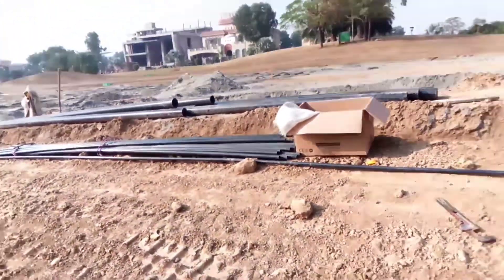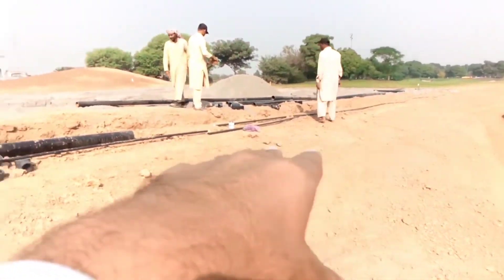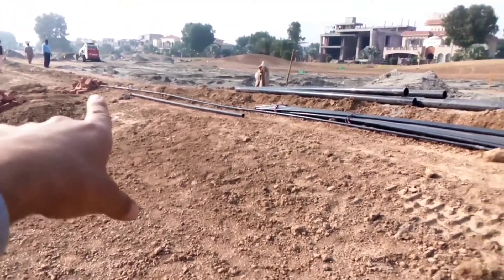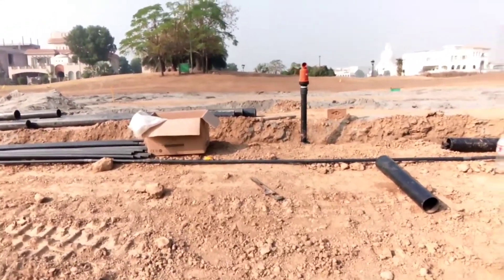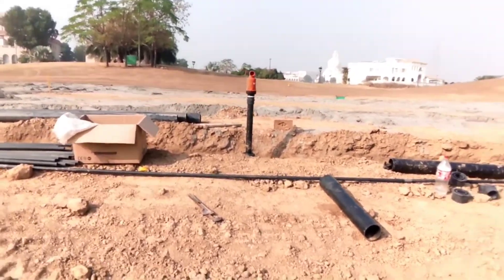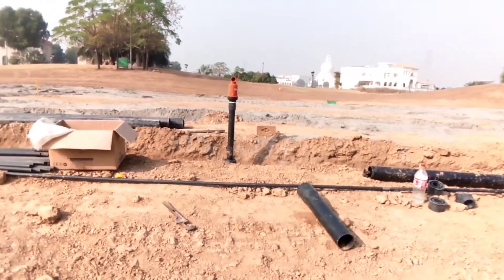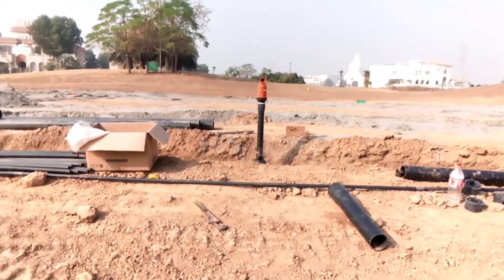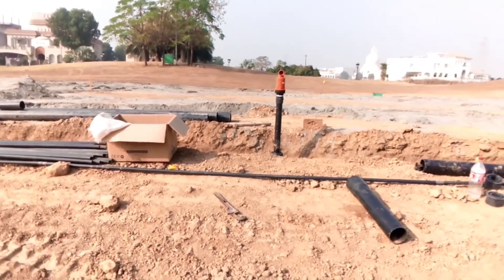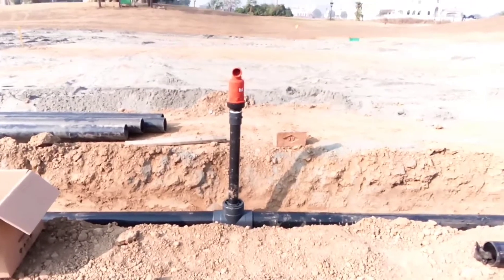Let me show you the contour. This is the high area — as you go along, it drops that way, and from there onward that area is also dropping. So this is the high raised area, and that's why on all the raised areas we need the air release valve and vacuum release valve. If you don't install these, the trapped air inside the pipes will damage your pipes, or the vacuum that creates inside your pipe will damage your pipes. Be careful with that because it can create a big problem.